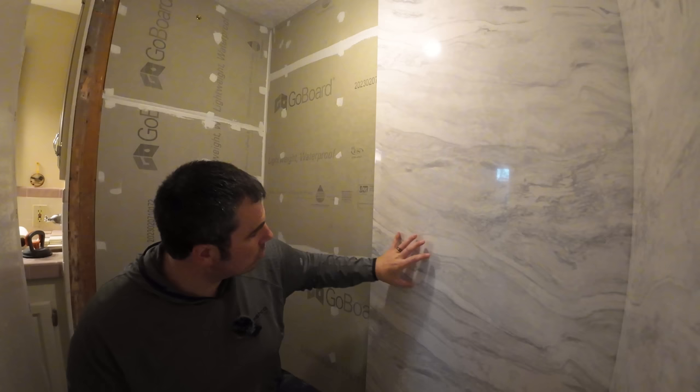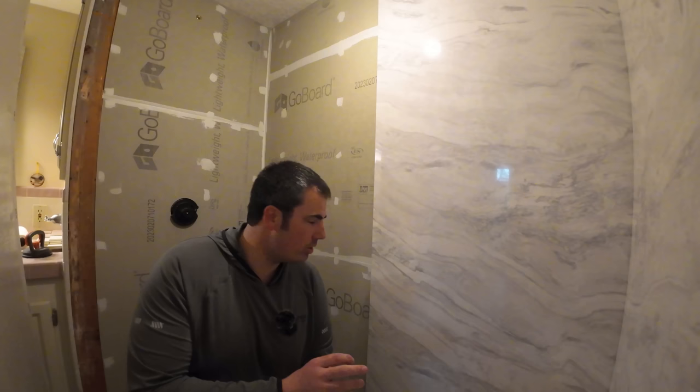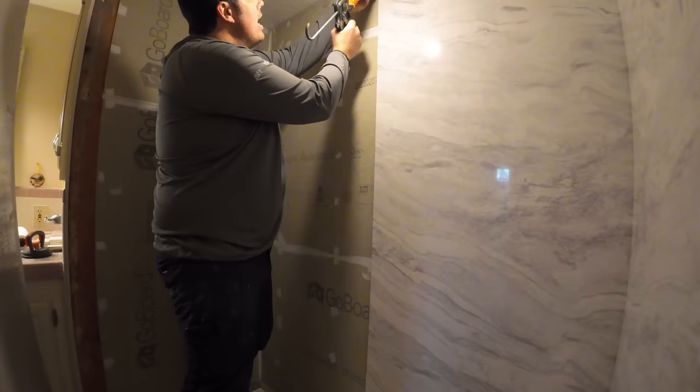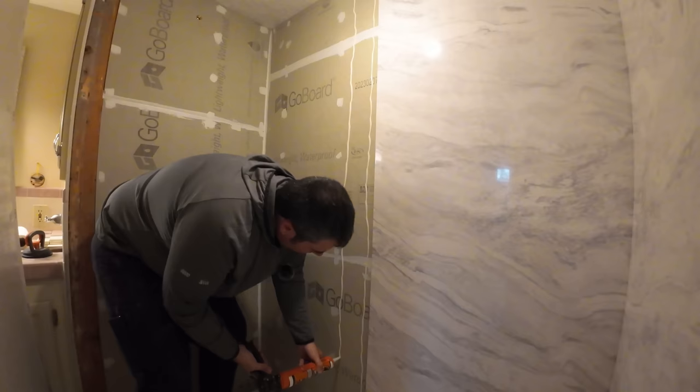And what that does is it helps take your eyes away from the seams that are there, right? So you have to really pay close attention. Each panel has its specific place. So starting from left to right, A, B, C, and D. So we've got C installed, we've got D installed. Now we're going to install panel letter B, excuse me. What's nice is CASTICO gives you two different methods to adhere the wall panels to your waterproof membrane.